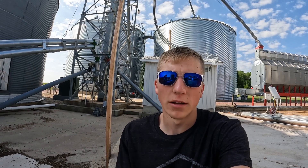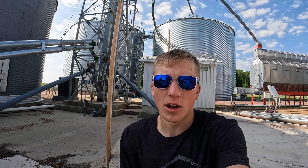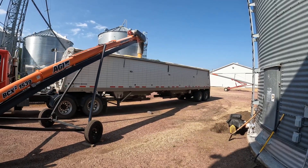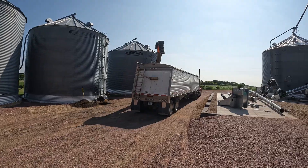I personally love this Batco conveyor for two reasons. Number one, it's a lot better on grain quality — being a conveyor instead of a screw auger, it's more of a belt style, so it's easier on the grain. That means we don't get docked as much at the elevator. Reason number two is speed — it has an eight-inch tube but it actually runs like a ten-inch auger, filling a truck in about 15 minutes. I have the sump on the bin wide open, so those are the reasons I absolutely love this auger.